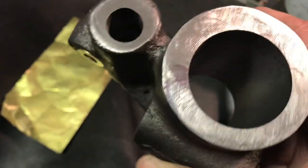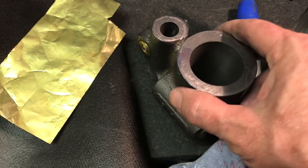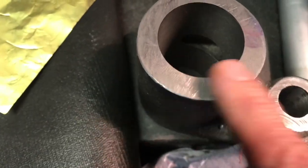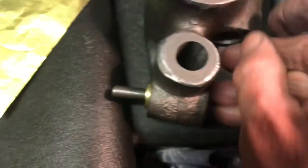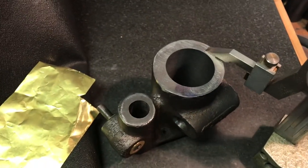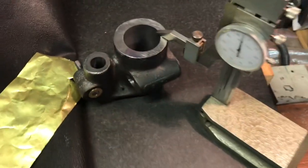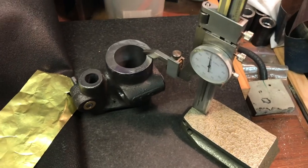You can see the part that's been filed. Years ago when I was in college I built a rifle — part of that process was draw filing the barrel on an old-timey black powder rifle with an octagonal barrel — so I am experienced with using a file to remove mill marks. You can see there are still mill marks on part of it, but the high area has been filed down. Now I've got a uniform thickness, which is really pleasing. If you have a height gauge and a surface plate, you can do this to double-check things and make the tool that much more accurate.